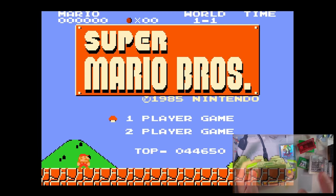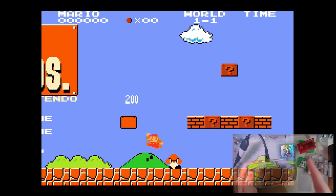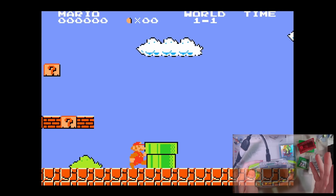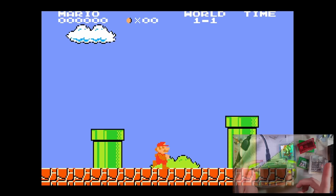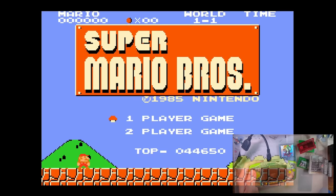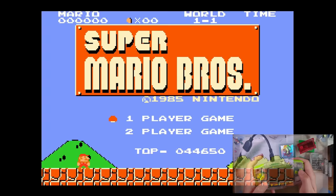So on a normal GBA screen, that is to say the OEM one, the stock one, it's fine. You don't notice this. The stock screen hides these defects pretty well. Unfortunately, IPS kits, like I said, some of them are particularly sensitive to flashing elements on the screen, and this game is certainly no exception, and this causes artifacts out the wazoo with those kits.